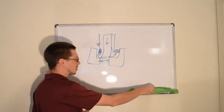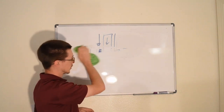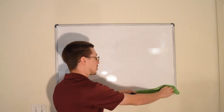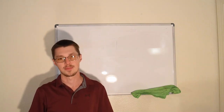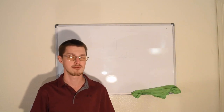And so what we've been doing to sort of rectify this problem is digging through the literature and doing a little research on how people in foundries work with molten metals and work with hot metals in general. And it turns out that there's a few different ways to resolve this problem that people in friction stir welding and in foundry work more broadly know about. There are materials that are effectively non-wetting at elevated temperatures to non-ferrous metals.